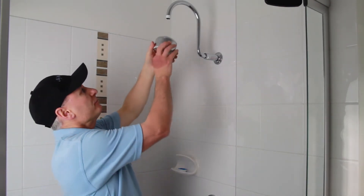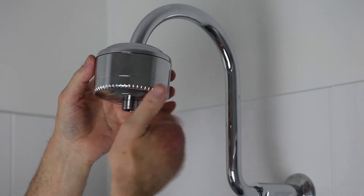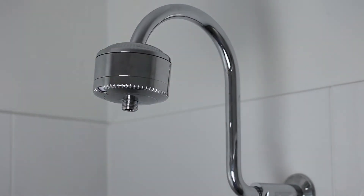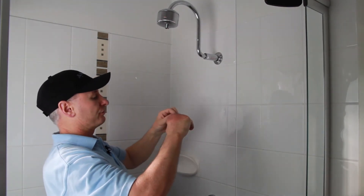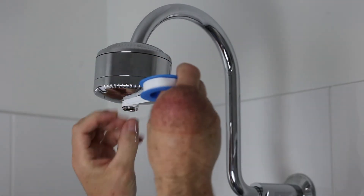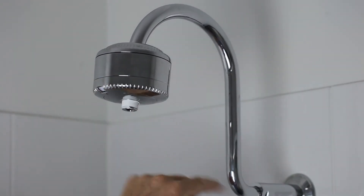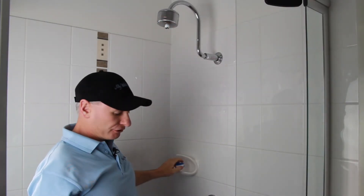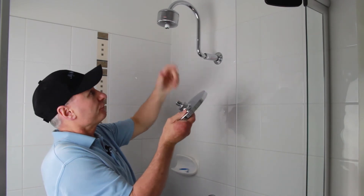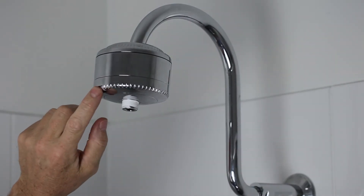Then we're going to get the shower filter — there's our thread. There is a rubber inside that seals as well as the tape, so I won't get too carried away. We'll just nip him up to there — that's beautiful. Then we're going to need another little bit of thread tape to make sure we get a good seal on the shower head as well. That'll depend on the quality and age of your fittings. This is all pretty new here, and we've got a good rubber seal inside this shower head, and that's going to seal on the filter as well. At the top here we can see our date indicator still set on May — it's very easy to keep an eye on.